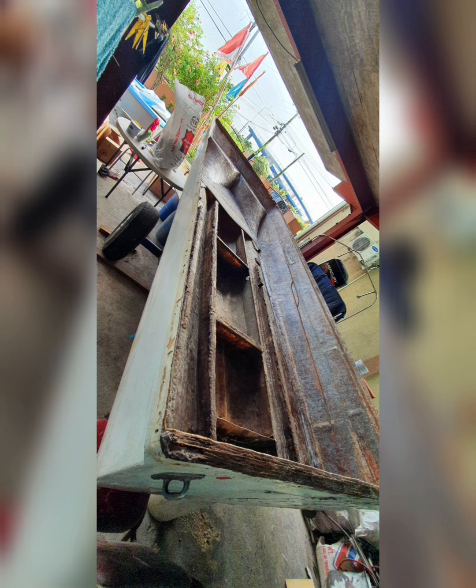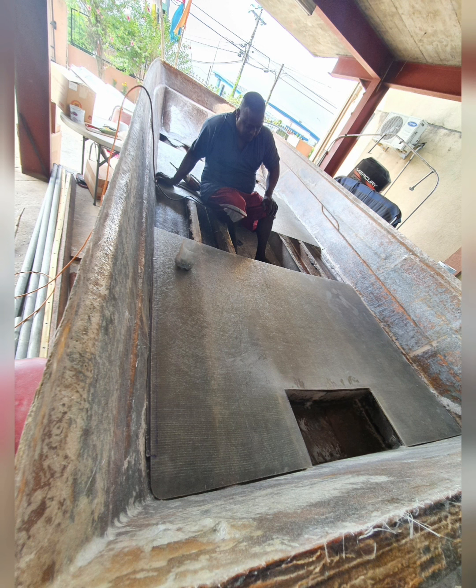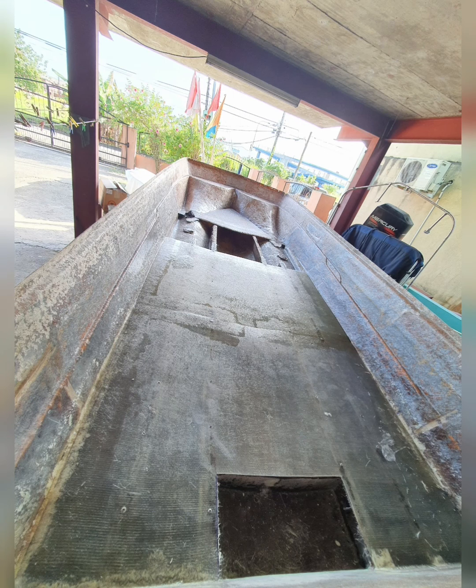Firstly we took apart the entire boat — the flooring, as it was plyboard and the ply was rotted, the top deck, and the engine bracket. We then molded fiberglass sheetings using three layers each of fiberglass cloth and matting. We then sanded down the hull and stringers and applied fresh glass and matting back before installing the flooring.